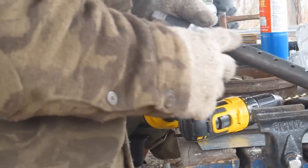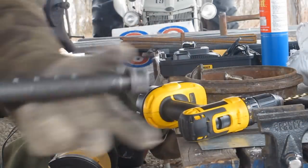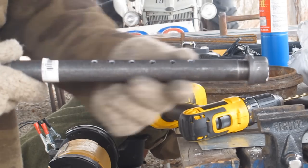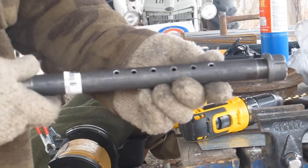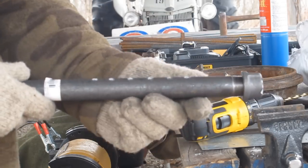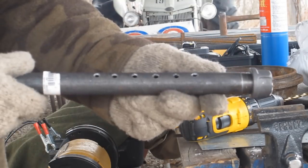We've got six holes in this piece of pipe — this would be our plug on the other end. We'll put a cap on that so we can clean it out real easy, just take that cap off. This is going to be the center of our pit forge, where our air blast is going to come from. Everything here will be surrounded by coals in the pit with V's of fire brick.